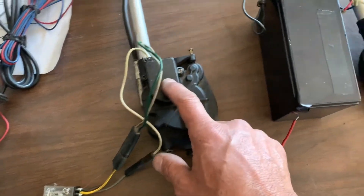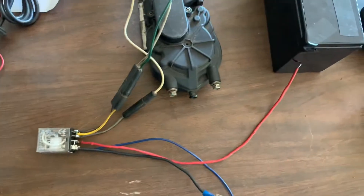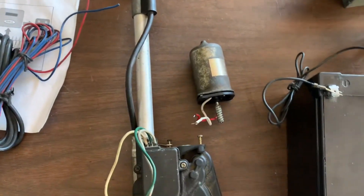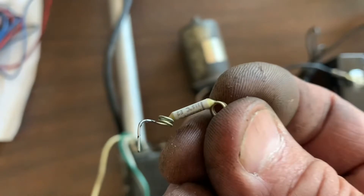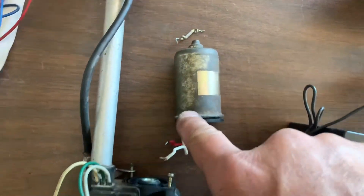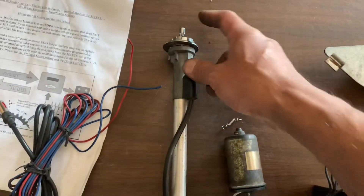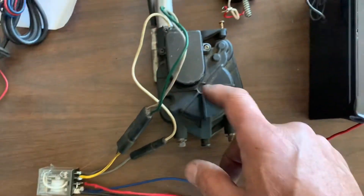I can't show this one working because as I was ohming out the contacts to verify the wiring, the relay was clicking but there was no power on one of the contacts, and I realized the motor had no continuity. I hooked it to 12 volts and the motor wasn't spinning. So I opened up the motor to check if the brushes were worn down, and found a little pico fuse — a 2-amp 250-volt inline fuse — that was blown. The brushes were fine, so the mast was probably frozen and the motor ran until it overheated. With the motor out, the mast moves freely and I can see the gear rotating.